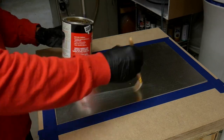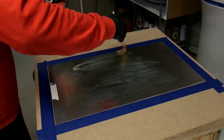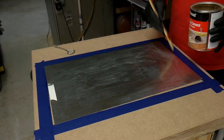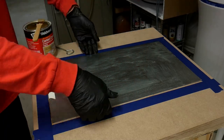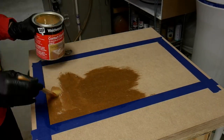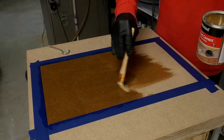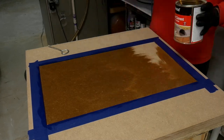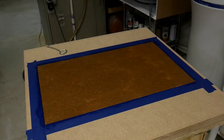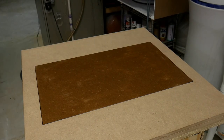The original idea was to hold down this piece of metal which I'm going to eventually drill holes into. I wanted a piece of metal with the holes already pre-drilled, but I just couldn't find anything, so I ended up finding a piece I'll have to drill myself. I'm using contact cement — if you've never used it before, you apply it on both sides pretty liberally, let it dry until it's tacky but not completely dry, then press them together and they should stick pretty well.